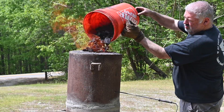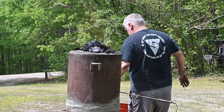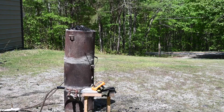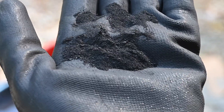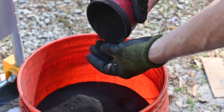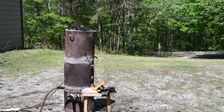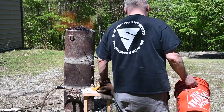Some people assume that this is just a melting process — like making clarified butter on a stove or something. It is not. This is a chemical reaction. The ore source is composed of either Fe3O4 (magnetite) or Fe2O3 (hematite). The oxidization of the charcoal is an exothermic reaction — fire, in other words — which is producing carbon monoxide and carbon dioxide.